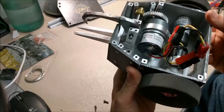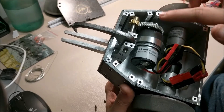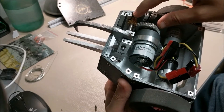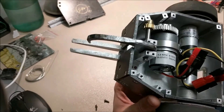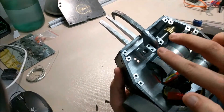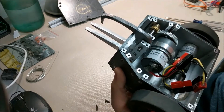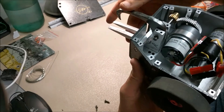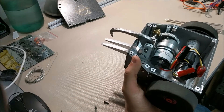Moving on to the main weapon mechanism. This is a half RPM DC 12-volt gear motor with a 3000-to-1 gearbox, and I'm actually down-gearing it further here. I went through a few different versions of the gear ratio between these shafts and ended up settling on this one for the best compromise of torque and speed. This was a retrofit design — you'll see some extra holes drilled for the column blocks. Originally the front teeth and the column supports were two separate parts, but I realized that by making them one part I could get a much stronger stress load path, so that when crushing something it goes straight through into the shafts with no weird bending anywhere in the chassis.